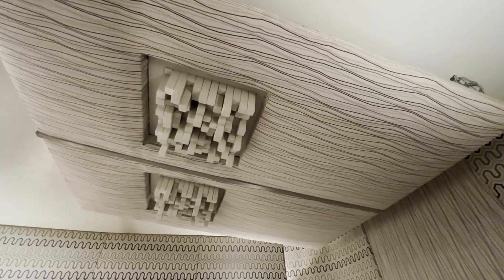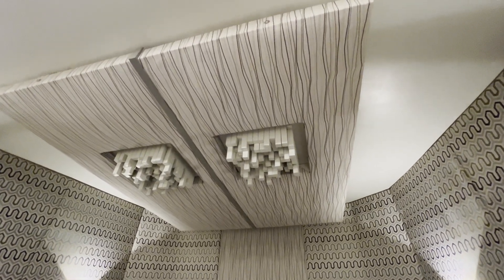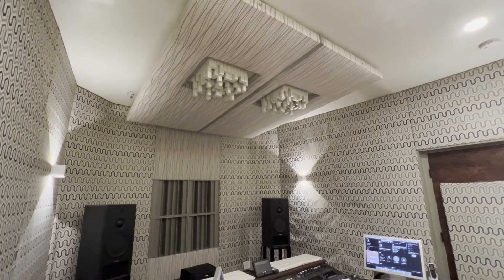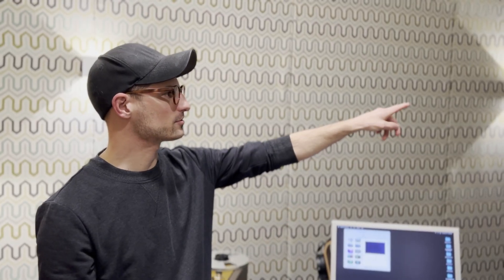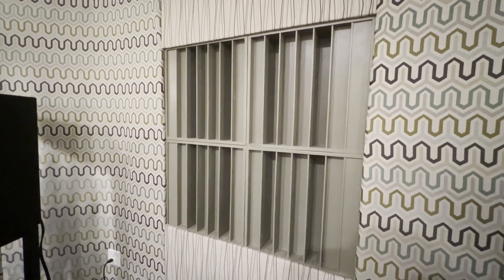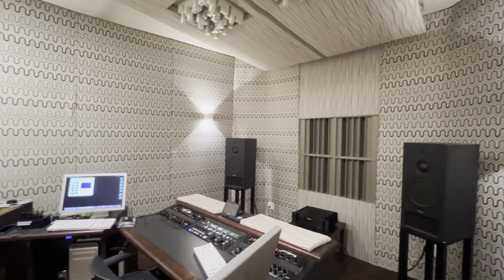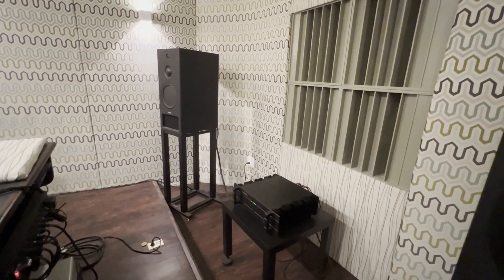So the cloud itself is a two-inch thick rock wool. There might be some different layers in there as well. I put diffusers right above the desk to try to avoid as much direct reflections off the desk as I could — sort of diffuse that out. There are 2D diffusers right on the front, and they really help the speaker image a lot. Behind each one of the speakers there's four- to eight-inch thick Owens Corning — I think it's either 703 or 705.